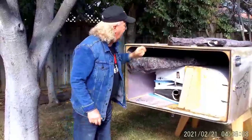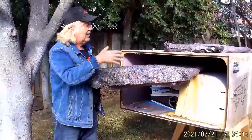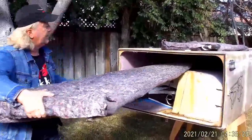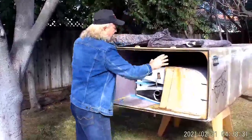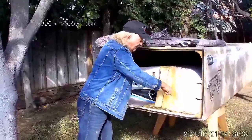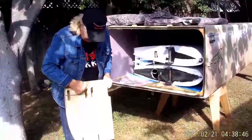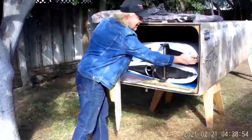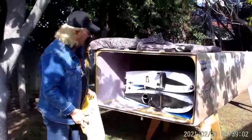Nominally, the winglet and wing tip are held in place with one-inch wide webbing straps tied onto the main wing sections. Two wing tips fit in here and two winglets go here — they all fit in and get strapped to the main wing sections. To deploy the glider, there's a series of thumb screws which I've already taken out. We take out the thumb screws and this swings out. You can see on the back side how I've designed it with notches to fit over the root end fittings of the wing and sit on the leading edge tube fittings, so the wing can't twist, can't go up and down, can't go side to side — it's well secured.